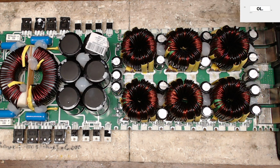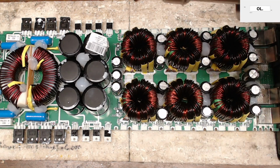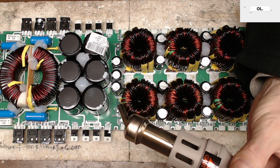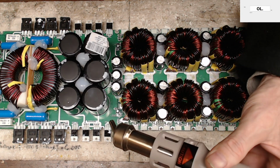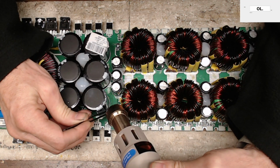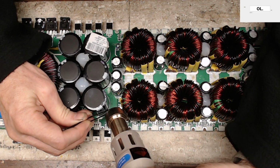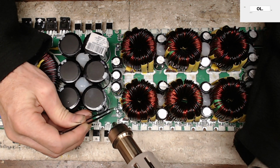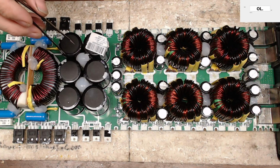All right, another resistor coming off the board. So that is going to be, what is that? That's going to be the 10 ohms that's feeding the drive circuit. I do believe, I'd have to look on the schematic. I'm going to go ahead and pull this off real quick here. Oh, and it broke right in half, so that was definitely a failed resistor.